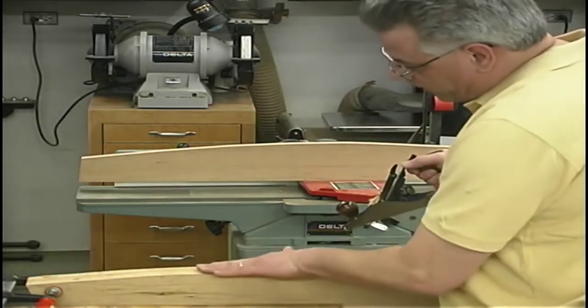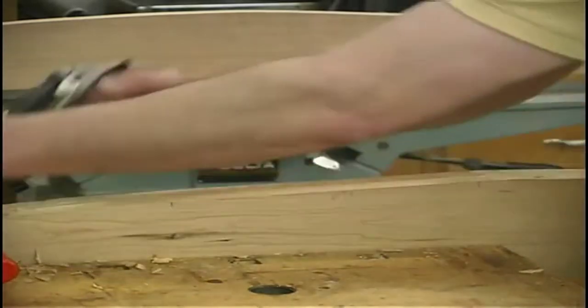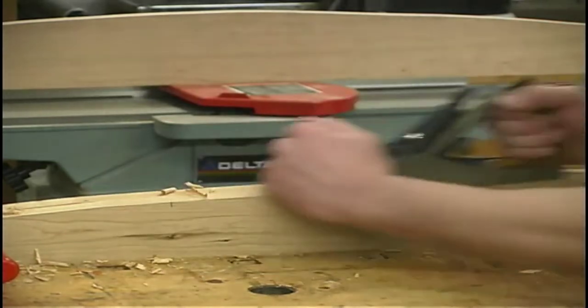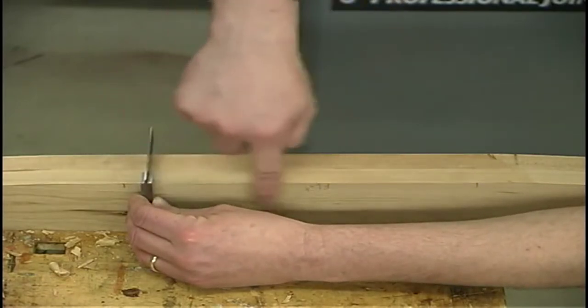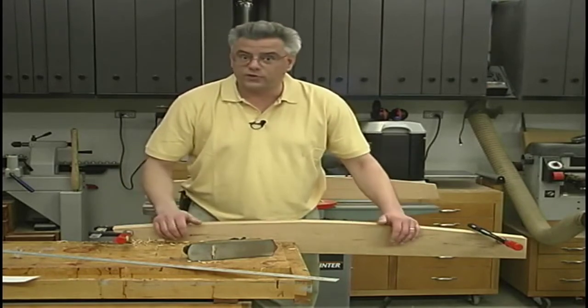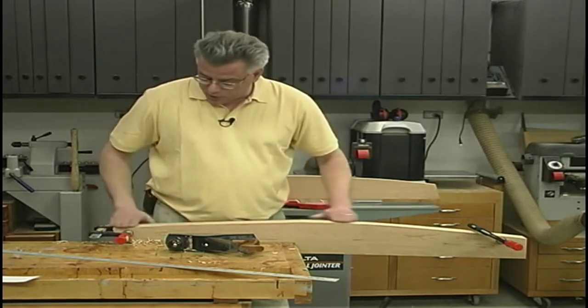My legs, as they're clamped together — the one at the back side is a little bit taller than the one at the front, so I'm just roughing that one down real quick. I'm a little bit low here and a little bit high back here, so I need to remove a little bit more material on the back side. Now that I've got the surface relatively flat and close to my layout line, I want to take a square and make sure that my edges that I'm machining now are in fact square to my faces. At this point you can go through and shape out the convex portion of the rest of the curve, and you can do that with your hand plane as well, or belt sander, or whatever tool you're using. Now I'll get that same mating flat surface on the other leg half and then shape up this convex curve.